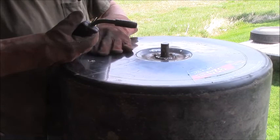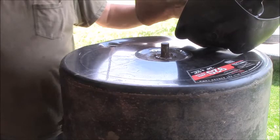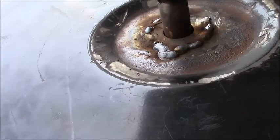Let the machine run for a while and cool itself, and I'm going to stop sweating for a while. Well, I ground down the welds, and any place that looked like a little pinhole or perforation I went and re-welded, so you can see the nicely redone beads on top. Now this is going to be covered by a cone, so I don't really need to grind those welds. I'm going to leave them — they look fine. I'm going to brush it up and paint it with some Rust-Oleum after I get done welding the rest.